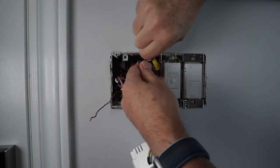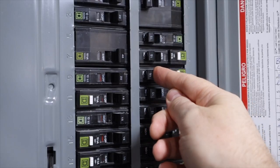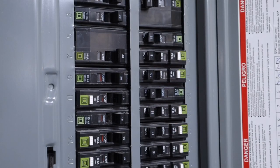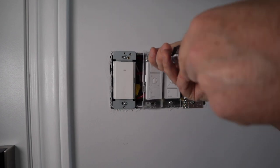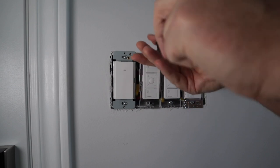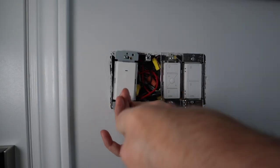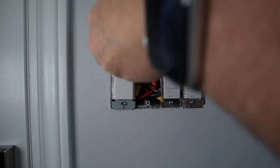It's basically as simple as connecting each of the wires from the switch to the wall. Of course, make sure that you've disconnected the power before installation. I'm installing Eve Light Switch in a four-gang box, and as you can see, I've had to remove another switch in order to get a hold of the neutral wires. Luckily, this is just a Pico remote, so it doesn't take up much room. But one of the biggest challenges I find with smart switches is tucking in all the wires and getting everything to fit, especially if you have a double or triple gang box with all smart switches. Totally doable, just takes some patience and a little finessing sometimes.